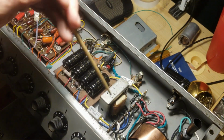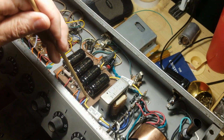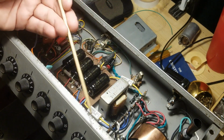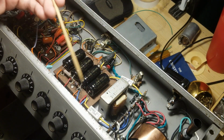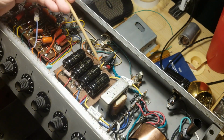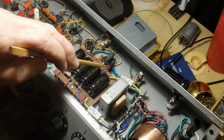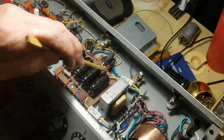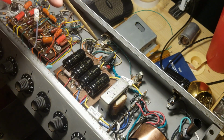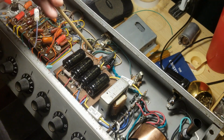I'm balanced. I got one on the positive side and on the negative side. I could have put a 200 over here and gotten the same thing, but by splitting it, you have, again, a quieter power cycle thing going on here. And with this big 200 ohm cathode resistor, an old school bypass cap here, I've got 331 on the plates, and this is at 12.6 volts.